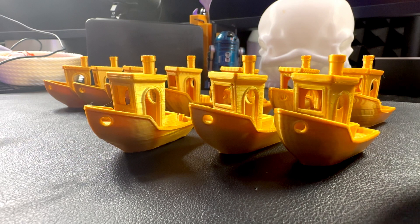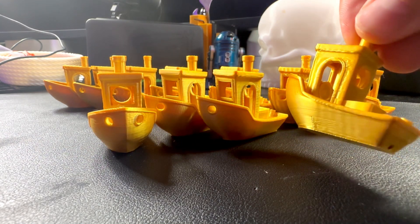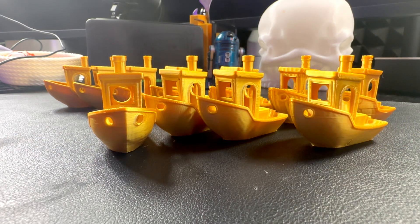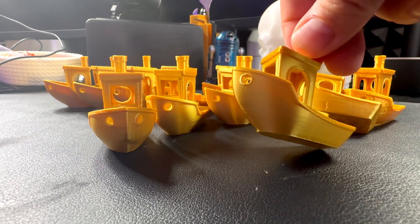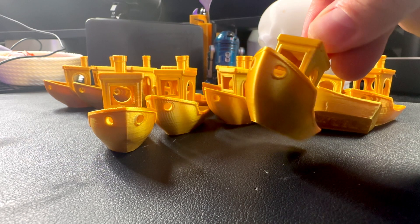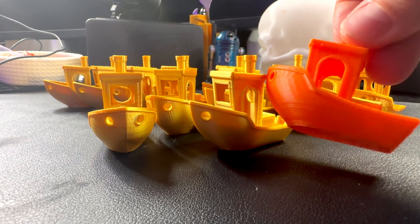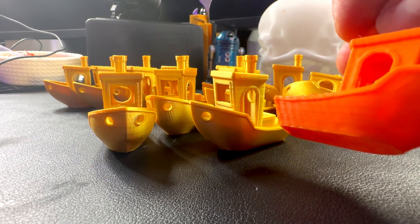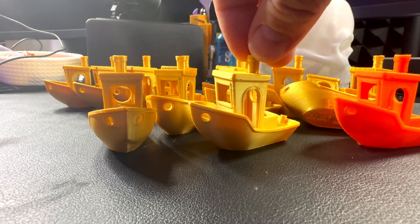Around 40 minutes with speed variations of 500 then going down to 250mm/s, we really started hitting a sweet spot. The final 40-minute Benchy was the best of the bunch — we're not printing at 50mm/s anymore, and a good print at 250mm/s is still well worth the time. There's also a non-silk 17-minute Benchy at 500mm/s: you can tell what it is, it's not a massive fail, but the 40-minute one is the favourite.